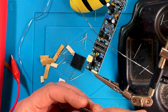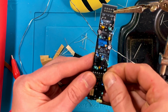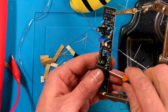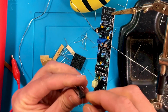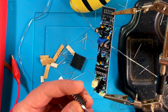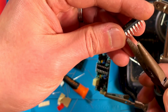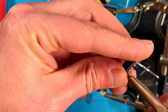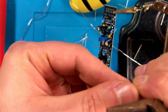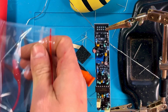Let's plug in that IC socket. Now you'll notice that one of the little legs got squished. See, it didn't quite go into the socket. So we're gonna have to fix that. Pull the IC back out. I used a combination of my fingernail, the screwdriver, and eventually a pair of needle nose tweezers to gently and carefully adjust that little leg, because once it's folded once, it's fragile. But now here it goes, plugged in perfectly, no issues.